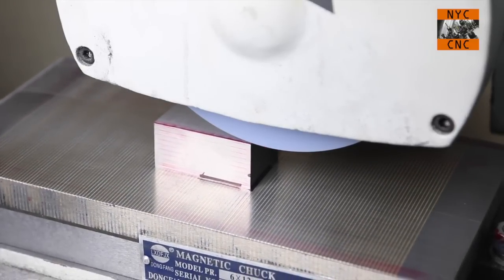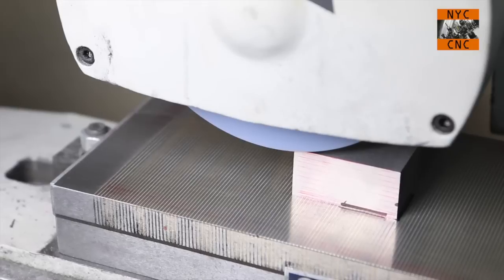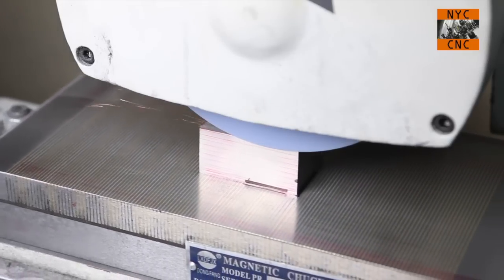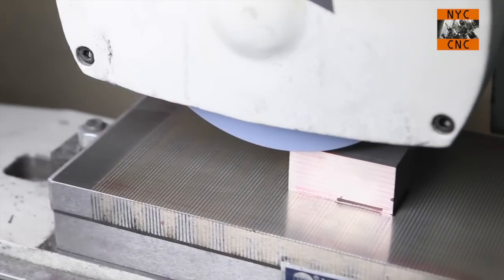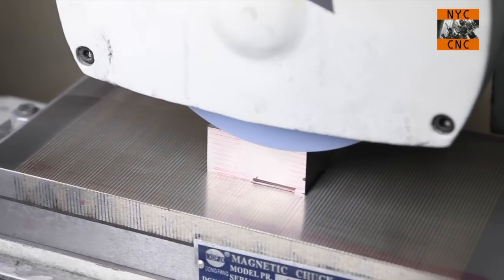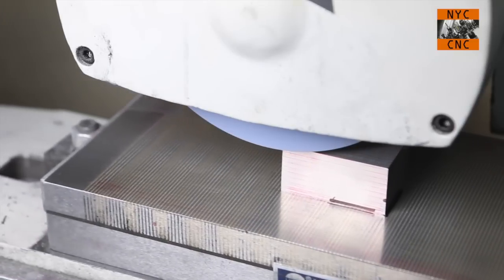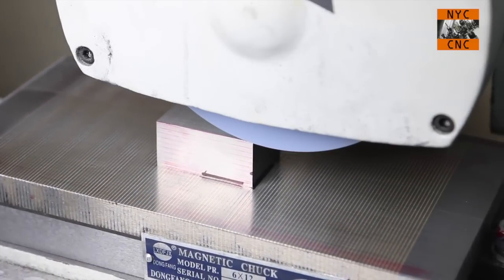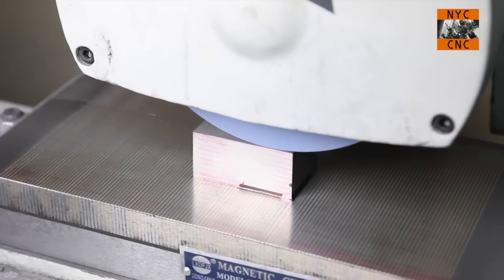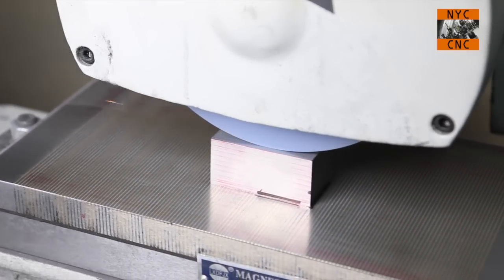So again, nothing other than fun and to show off a whole different level of precision. And it's really cool. I've really fallen in love with the precision and the surface finish and just having fun with this. The parts I was making for that customer were adjustable parallels, and so you finished machining the parallel, you assembled it, locked it down, and then ground the two surfaces parallel to each other. And man, they just had a great feel to them and really made me appreciate this.